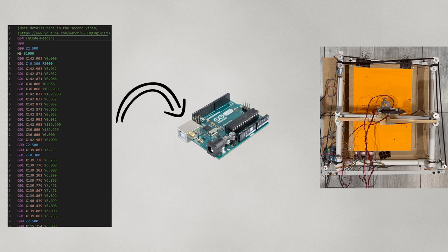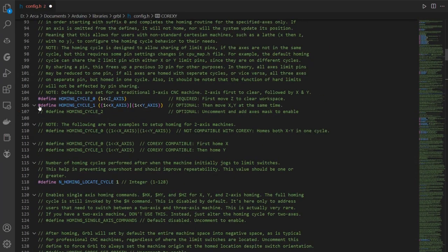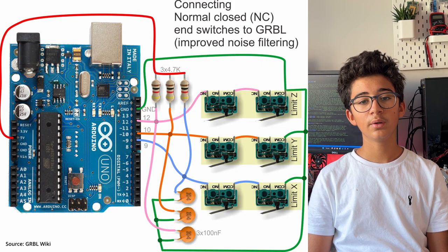For the firmware, I'm using GRBL. Whilst it was originally made for CNC machines, it also works well for a pen plotter. It essentially receives G-code from the computer and translates it to motion on the motors. To install it on the Arduino, go to the GRBL install guide — link in the description — and follow the instructions. Before you upload, you need to change the config.h file first. Scroll down and uncomment define CoreXY. Then scroll up to the homing cycle, comment out that line, and uncomment those two lines. We still want homing on the Z-axis, so change this 0 to a 1, and change this 1 to a 2. We need to do this because we're using a CoreXY setup, so we can't home both the X and Y axes simultaneously. I have two limit switches on each end of the X and Y axes and a single limit switch on the Z-axis. The X and Y axes switches are connected in series, and I've also built a mini circuit to filter out noise on the connections to prevent false triggers. There will be a link to the schematics in the description.